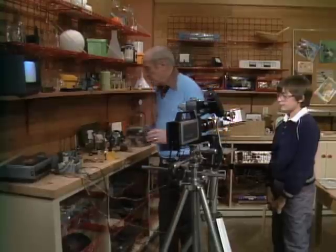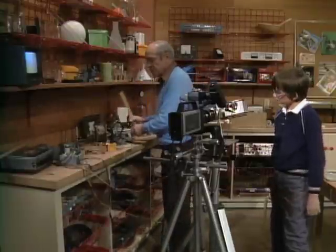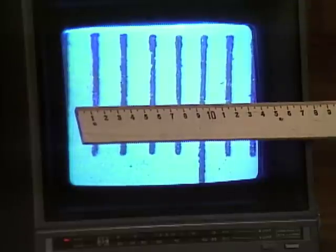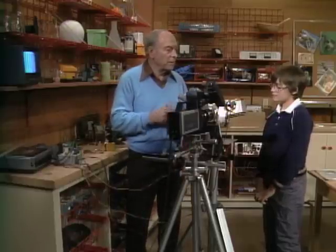Now let's see how much magnification that is. Here's my little television monitor. What's the width of the screen? It measures 15 centimeters — 150 millimeters. Now, I'll put a scale here with my microscope, so it's a really long lens setup, and there are millimeters again. How many have you got? One, two, three, four, five, six, seven. Okay. If we take seven millimeters and magnify it so it takes a space of 150 millimeters, how much are we magnifying? Around 20? 20 times. That's a fairly easy magnification to achieve with a water drop microscope, and if you make a really tiny drop and get everything working right, you can get up to 40 times.